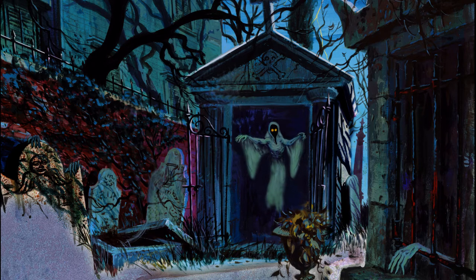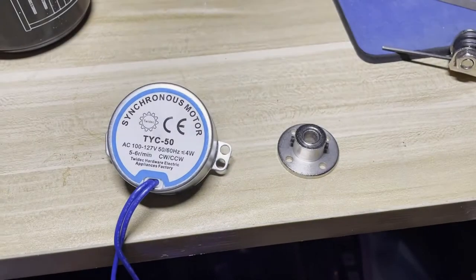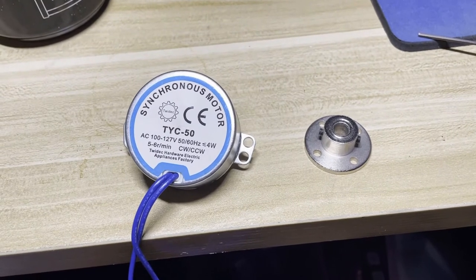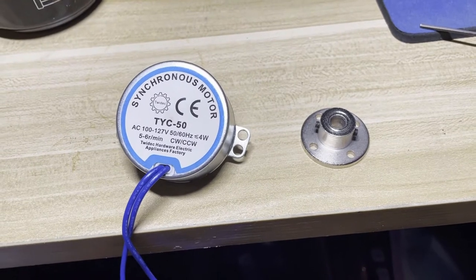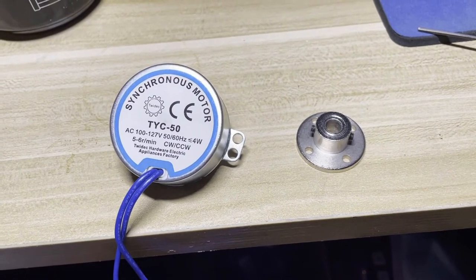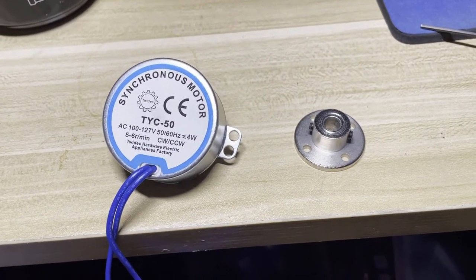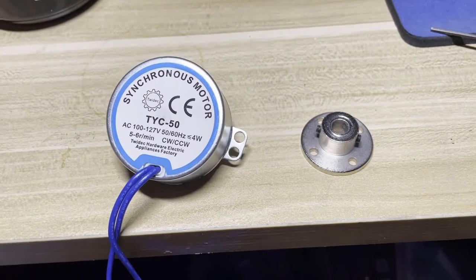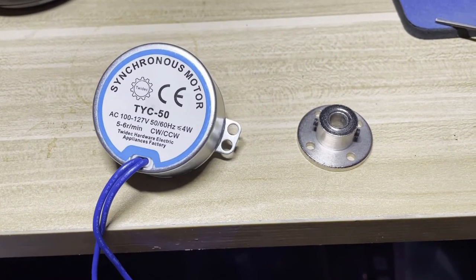We will be making this new marionette in three sizes. The first and smallest we will finish in this first program. I have redesigned the motor platform for the new system around an affordable but sturdy motor available from Amazon. At the time of this production the motor was selling for around $6, and it has more than enough torque to run the first two sizes of marionette with no counterweight needed. I'm not sure of the durability of the unit, but my guess is that it should deliver for at least three or so seasons. It is certainly no big issue to replace it should it fail.